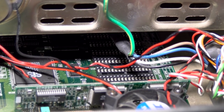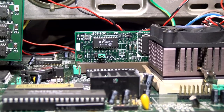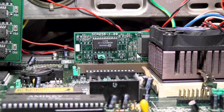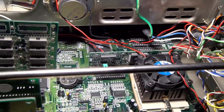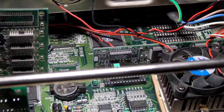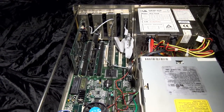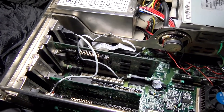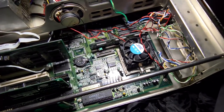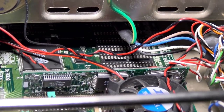It is a slightly unusual motherboard, if only for the fact it offers both DIP sockets and a COAST slot for the cache. The cache stick has a jumper on it, which suggests you can use both at the same time, but other sources suggest you can't. We could try it, as it likely wouldn't destroy anything — but that's for another day, and I'd have to do some probing to make absolutely certain. Notably, this board does not appear to support burst cache; I could find no such option, so you're stuck with regular asynchronous write-back cache, more akin to what you'd find on a 486 board.